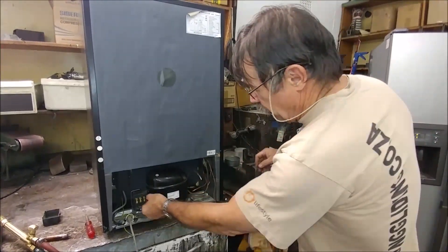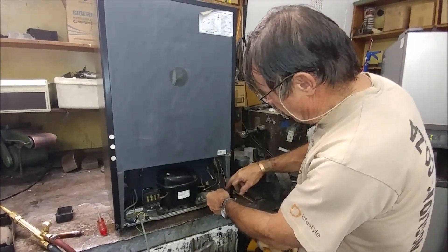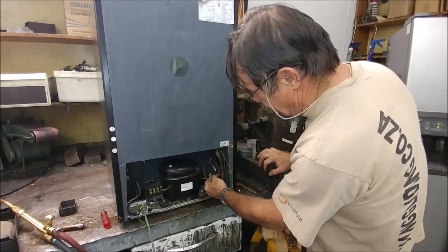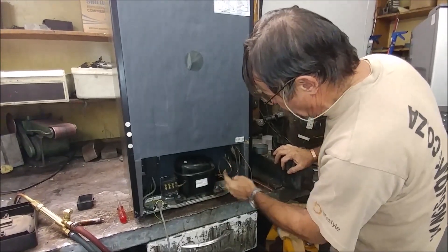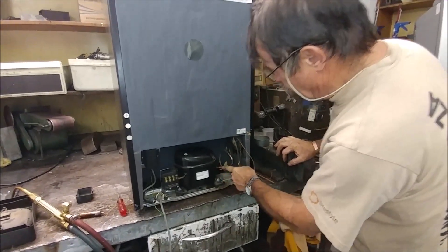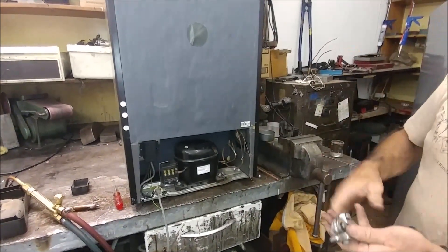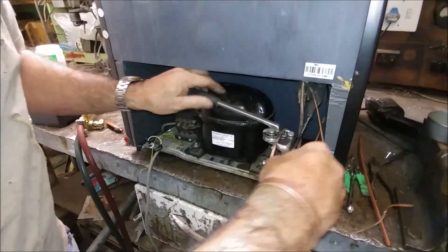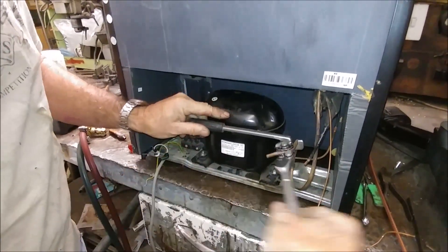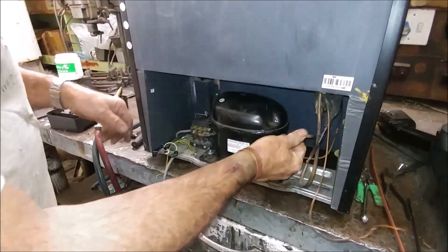Before we pull these rubber plugs out we prepare the tubes so that they line up. This is a 3/16-inch copper tube which is going to fit there, so that's going to be quite an easy fit. But this one here has to go on there, so we're going to need to make a sharp bend, and for that I've got this quarter-inch bender which we put onto the tube and just pull it across — it gives you a nice, sharp bend without kinking the pipe.